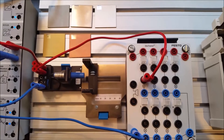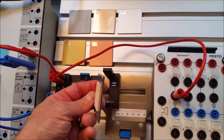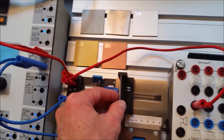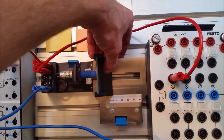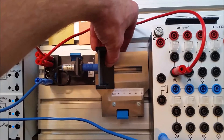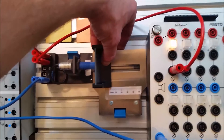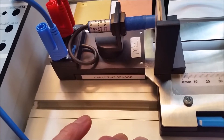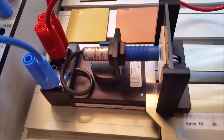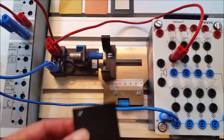Number ten is cardboard mounted on a plastic backing plate. From the manufacturer they said they weren't able to detect cardboard because it has a low dielectric. Pushing it in, I can see it, but it has to be quite a bit closer. Sensitivity adjusted in the back will give different people in the lab different outputs. The distance for cardboard for me is around two mils — it almost has to be right on top of the sensor.